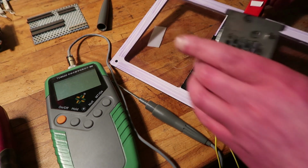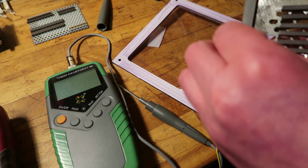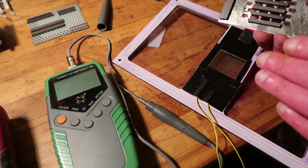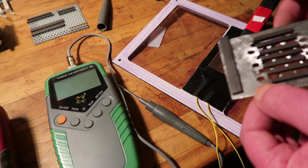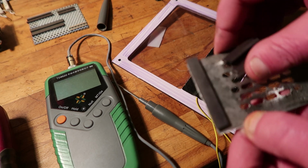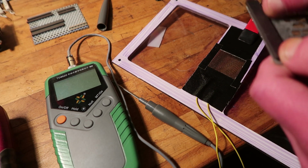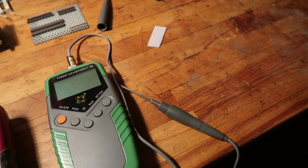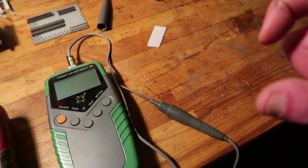There is a tweeter coil here, and I added some leftover magnets here and a spacer of 1 millimeter. So we measure all the output 1 millimeter away from the magnets to the coil. Currently it houses the old crappy magnet, which is really not strong at all. It can barely hold itself. I measured it with the neodymium magnets and also with the neodymium rubber magnet. I cut them all to the same length.